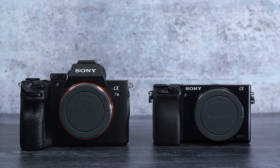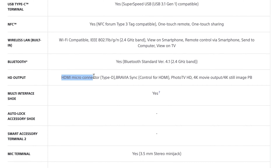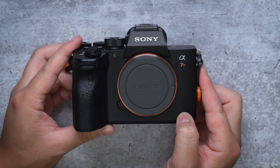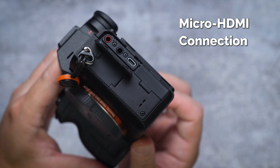Let's dive into the specifics to ensure that you have all the right gear. Just about every Sony camera, including the Alpha and the RX series, have a micro HDMI output port. But just to be absolutely sure, I highly recommend looking up your camera model to find out what size HDMI it uses — it will be either full, mini, or micro. There's a huge difference between a mini HDMI and a micro HDMI. I personally use the Alpha 7R Mark IV and the Alpha 7 Mark III, and both use a micro HDMI connection.